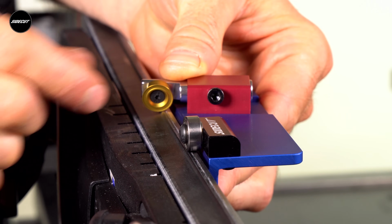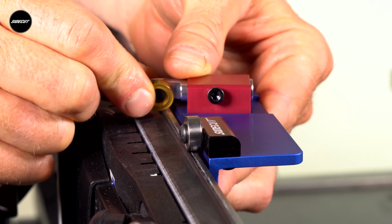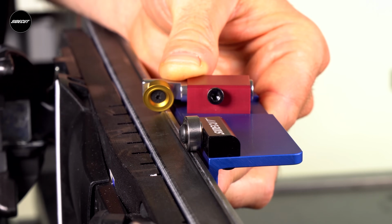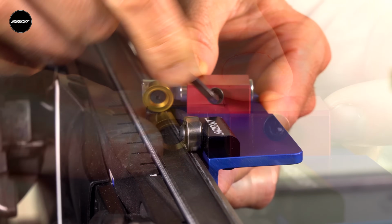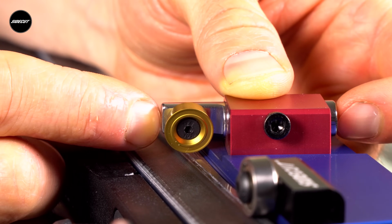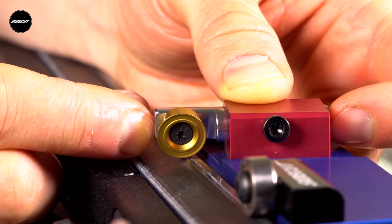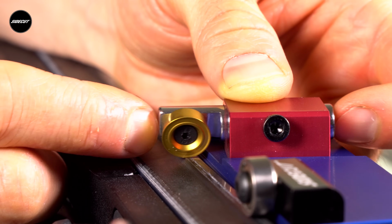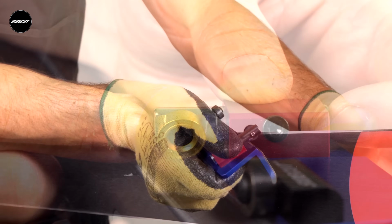Next, adjust your rake anywhere between 10 and 40 degrees. You'll need to experiment, however a slight twist most often works perfectly. Next, tighten the screw. Some key tips when using the sidewall remover are as follows. Get the locator pin adjusted accurately on the first pass so that it's removing the step. If it isn't, for instance the cutter is hitting the edge, then simply stop and readjust.